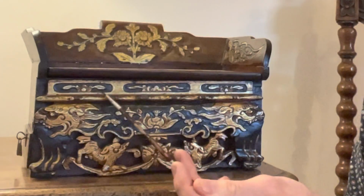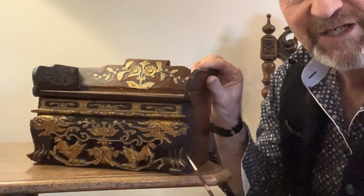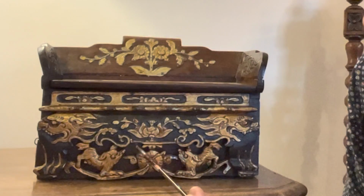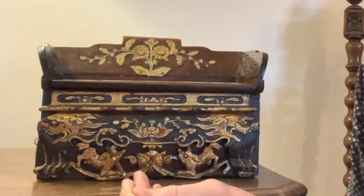And to prove to you that this really is a Chinese sofa bed, take a look underneath what is supposed to be the seat. And that's this rail here, this long, thin rail. That's the support rail for the seat. And the thing that's supporting that rail, you will see to both sides here, if you look very carefully, you will see two legs, cabriole legs. Follow the brush. Here's the shape of the cabriole. There's the apron to the base of the sofa, another cabriole leg there, giving the impression that all of this is open beneath the sofa.